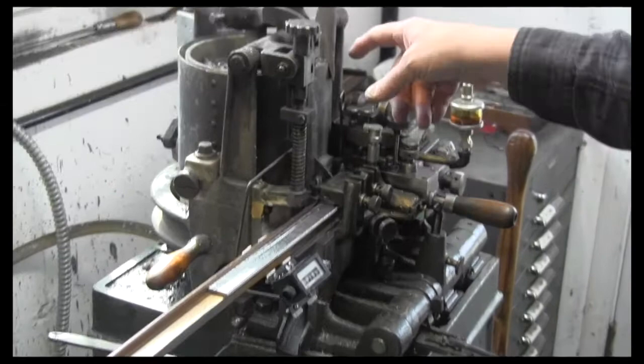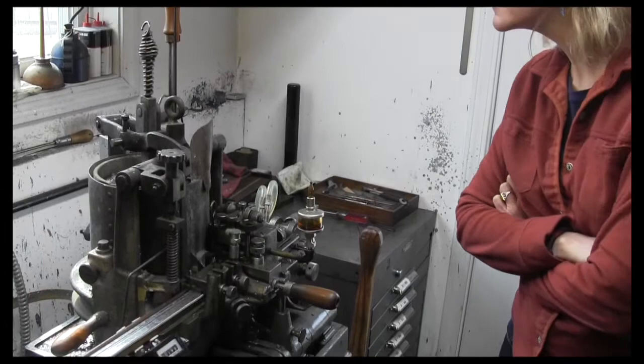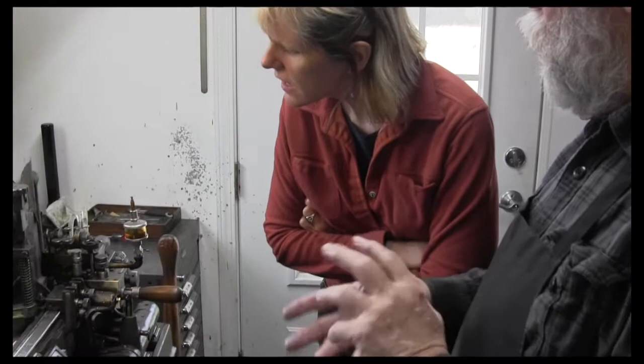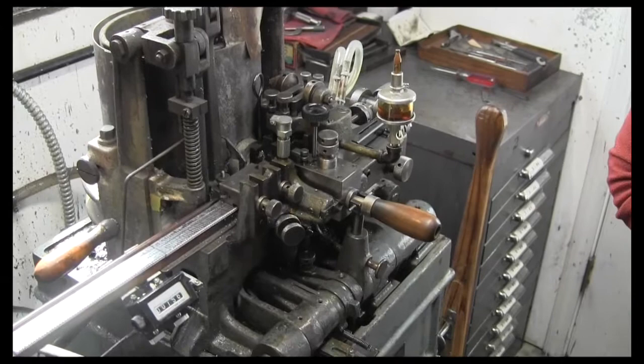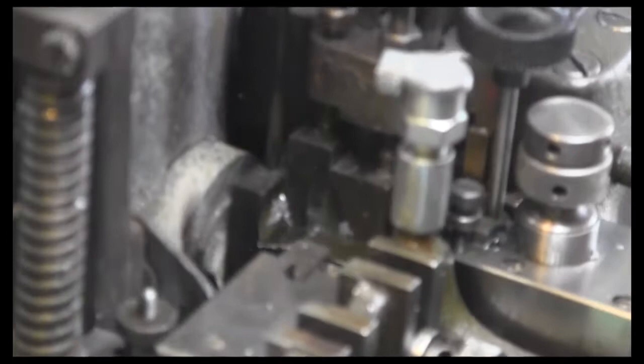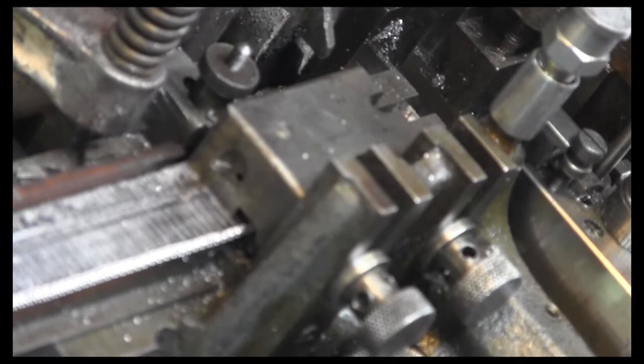So this is the piston and the mechanism, and the metal is in here. We're going to drop that piston, which squirts the metal into the cavity. The cavity is filled with air before it does the casting. There's a lot of oil around the mold, and it allows the air to escape. And what I'm seeing when it pulls back is the hot metal ready to come forward. Mm-hmm. It takes about 45 minutes to go from cold to 700 degrees.